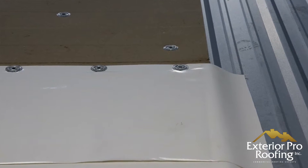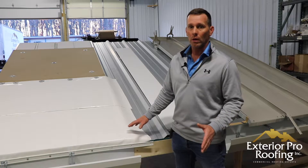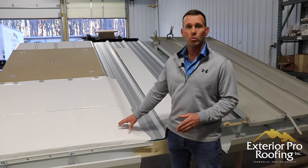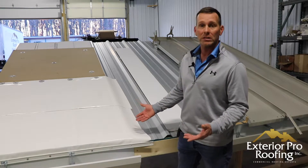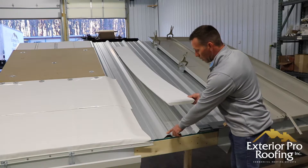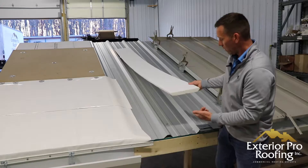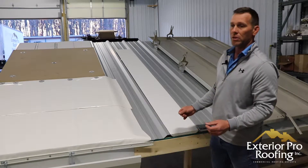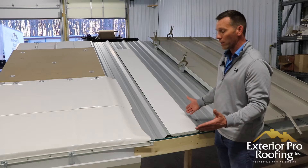Here is a membrane recover of a metal roof. A lot of people don't know that you can recover a metal roof at all — you can recover metal with metal or metal with membrane. It would start off like this: your existing metal flute is going to be based on a profile. We're going to cut insulation to that profile and lay it in the cavity of the metal, and it's going to come up basically flush with the profile. There are several different types of profiles common to our area and we adjust the insulation thickness, width, and height to fit the profile.